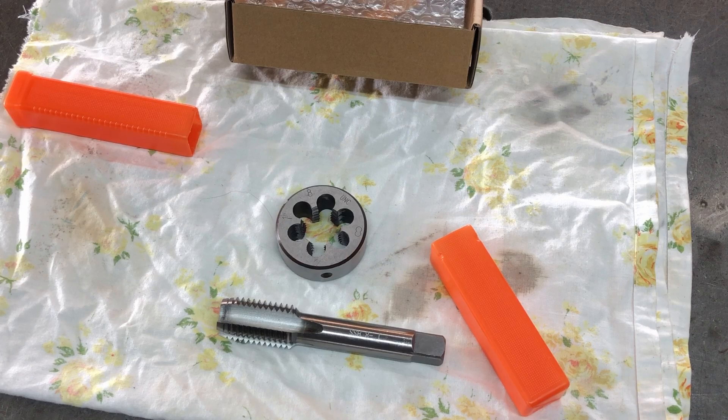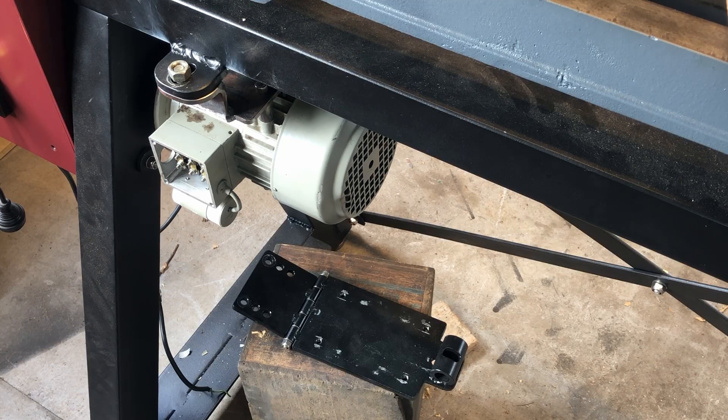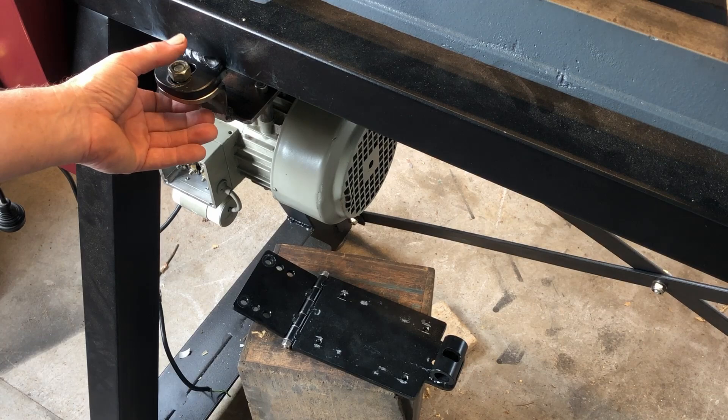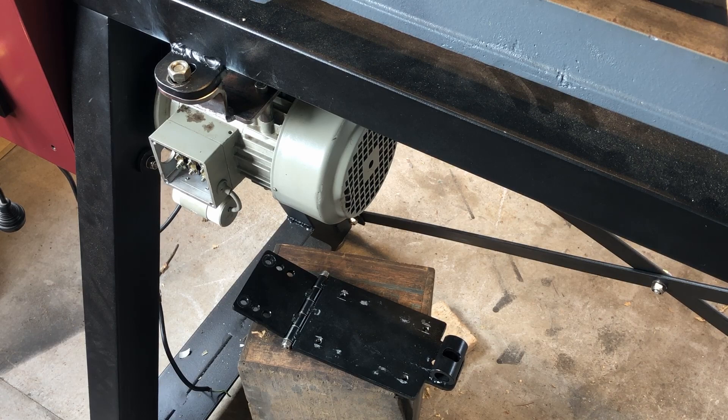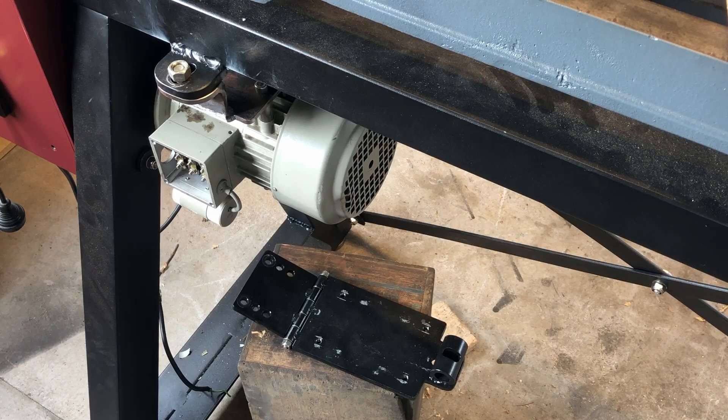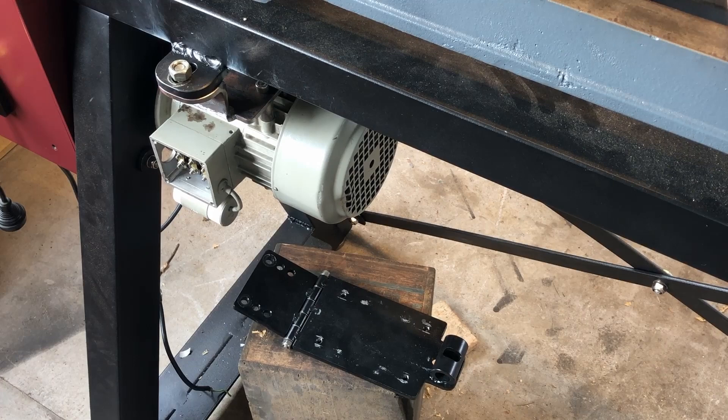I've got the tools now, so let me give you an update on what we've done on the lathe. I didn't film this bit, but I've installed another motor — this is a three quarter horsepower motor, which I think is going to be plenty big enough for this size lathe. I've made a bracket that just bolts on the back and has a bolt in the front. You can see the existing hinge bracket down the bottom, but because of the way these belts and pulleys work the tension on the belt is maintained by the spring on the lower pulley, so I didn't actually need the hinge part. This bracket just bolts on with no adjustment needed — I've aligned it up and it's pretty much fixed in position.